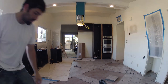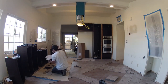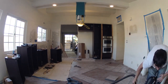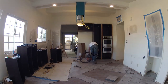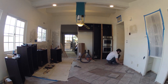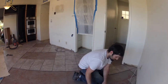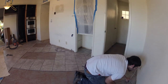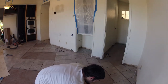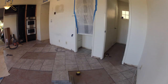At this point I had to run out to Home Depot — I wanted to get some heavy duty wall anchors for this upper cabinet section, knowing there's going to be a decent amount of weight between the three upper bridge cabinets and the two side upper cabinets. I didn't have enough studs I felt comfortable relying on just for the brackets, so I went out and got some really heavy duty wall anchors.